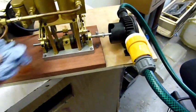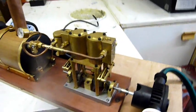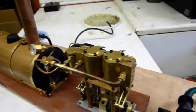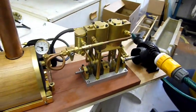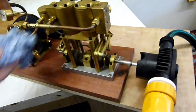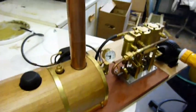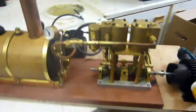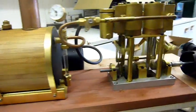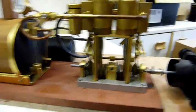See if we can get it going again — almost there. A little bit of moisture in the cylinders, should clear in a second. This little engine has actually got cylinder drains but I haven't used them yet. Clearing — picking up a little bit of speed. Got some real pressure up now, giving it another go. That's better — running about two bar. Condensate's cleared from these little cylinders, it's really flowing now.